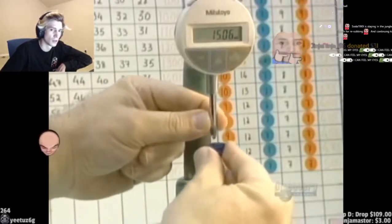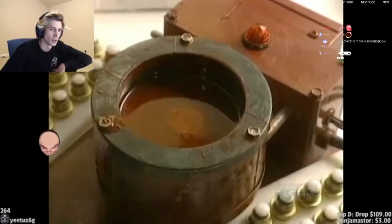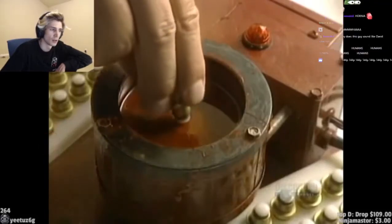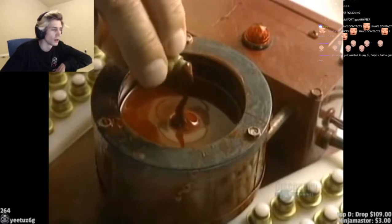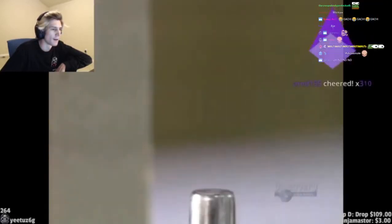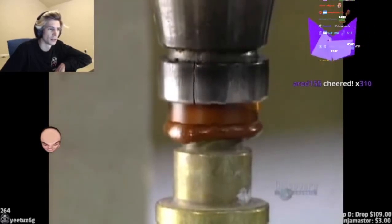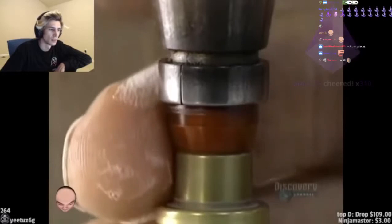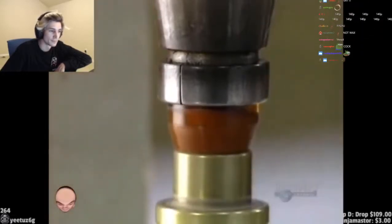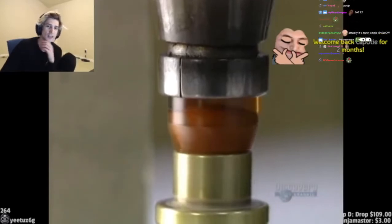A technician measures lens thickness with an extremely precise gauge. They now shape the outer surface, the part which touches the eyelid. The lens is glued with a special warm wax, and when the lens is completed, the wax will be removed by an ultrasound device. The wax takes on the desired shape in just seconds.